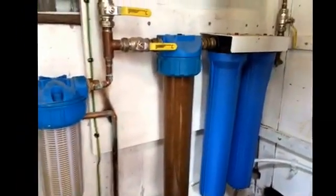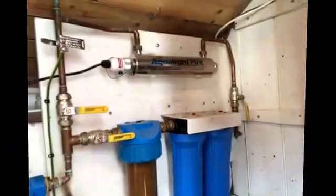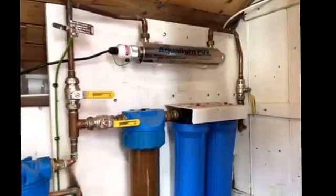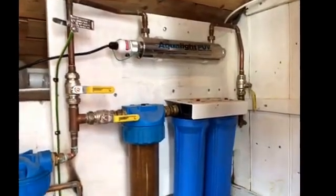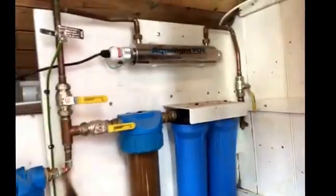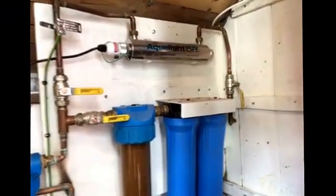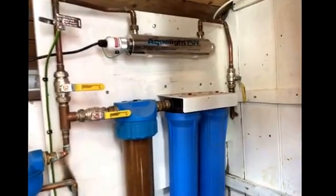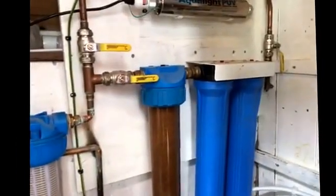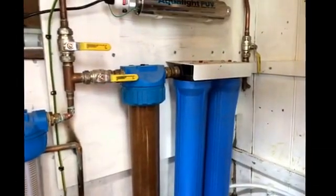As you can see here, I just dug the well out and let that come through but you can't even tell that's an issue. These work quite well. It's a UV light which basically does the same to microorganisms as it does to your skin — it kills it. It takes about 5-10 watts. You've got to be very careful how you spec those because you need to look at how much flow is going through them — if it flows too fast there's not enough light hitting it and it's not going to operate properly. Pressure wise they seem to take a good pressure, but you don't want this in a frosty area because it will blow to pieces.